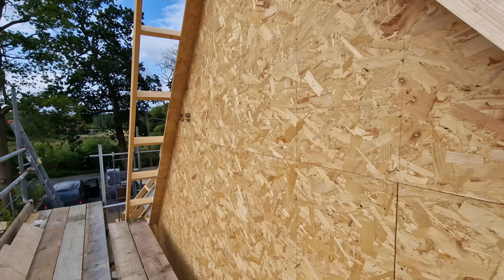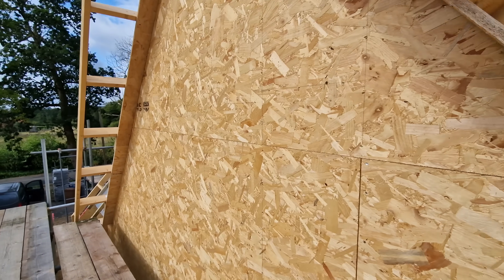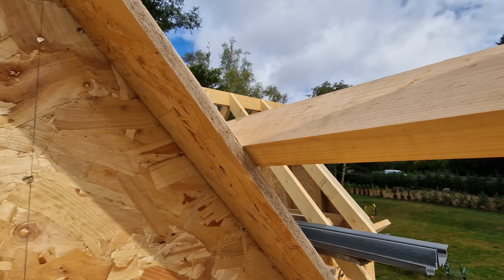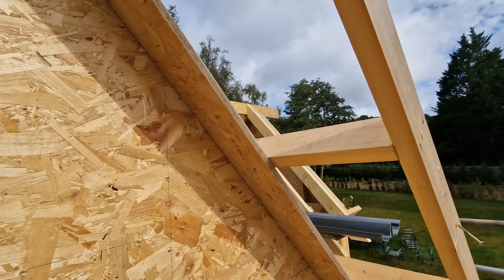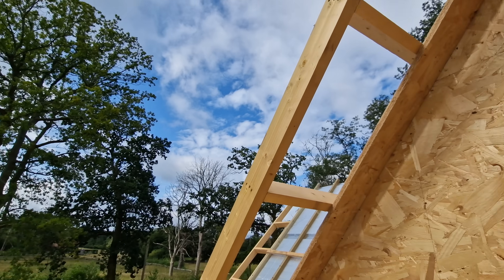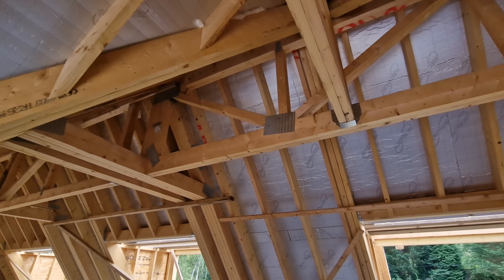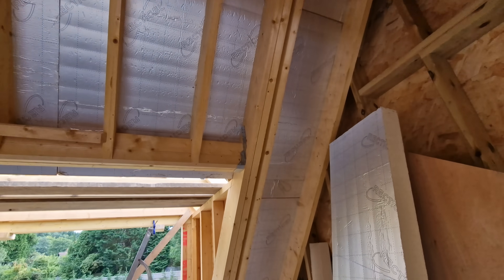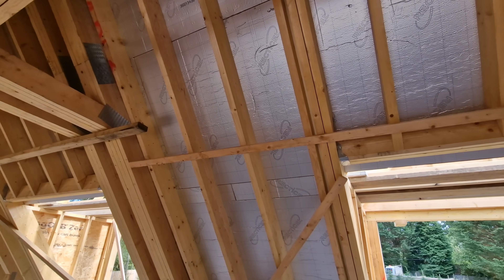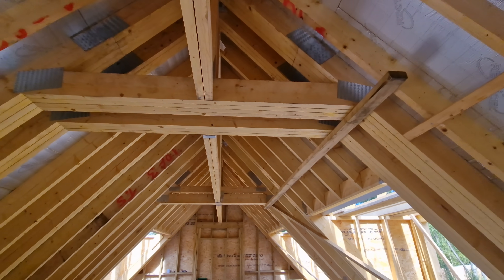Here's the front without the insulation on the gable — there's the 18mm OSB sheathing all nailed back giving rigidity, and the little plate we put on to make sure our insulation comes up tight against it. The reason for that plate is that if you went up against the fingers and there's any give, they'll just push into the PIR — so this adds a lot of support to the extended gable ladders which take the under-soffit and the barge board. Coming to the inside of the roof, it's completely covered everywhere with that external skin of PIR. Next we'll be insulating in between with the same thickness of PIR, giving 200 millimeters overall, and we'll use Gapotape as well.